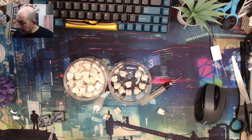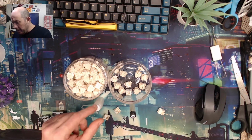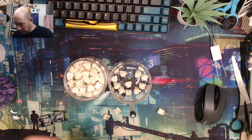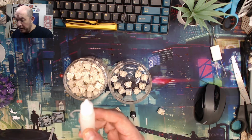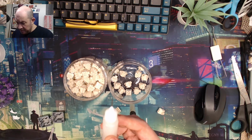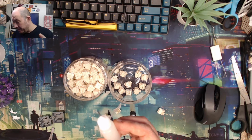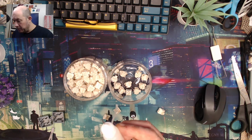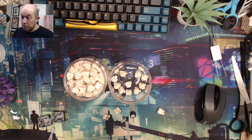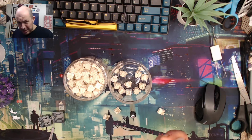If you've seen any of my videos before, you've seen my Time Budget Lube method. I am actually adjusting, and I will be making a new video. My mixture, I have been trying different ratios. I started with 50-50, 50% oil, 50% grease. I went all the way up to 80% grease, 20% oil. Right now I'm at about 70-30, and I'm starting to hone in on just the perfect amount where it's still viscous enough to stick, but fluid enough to come out.